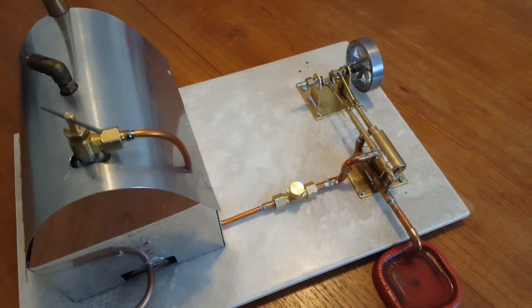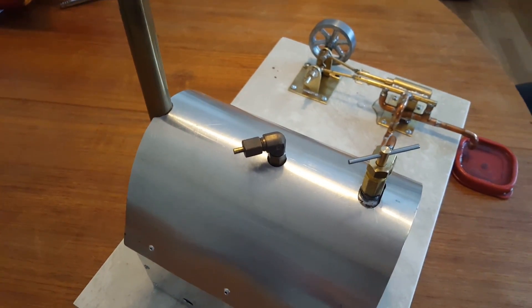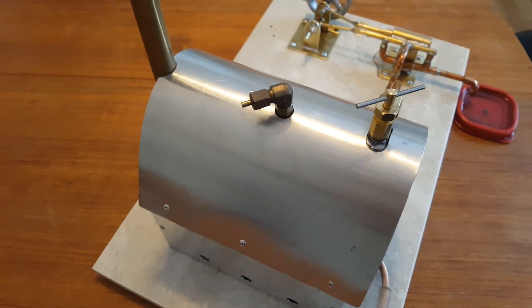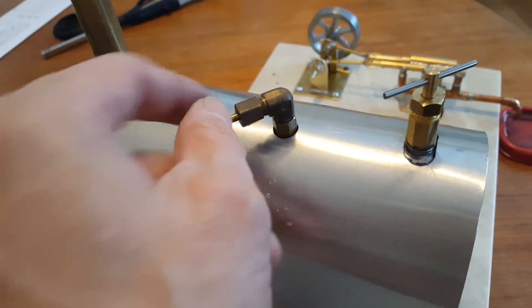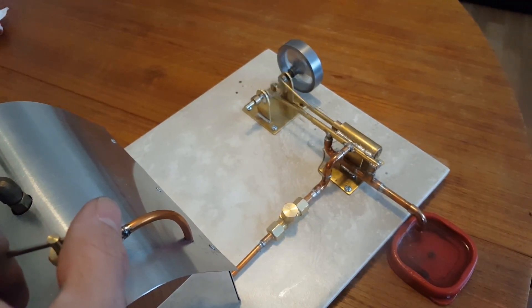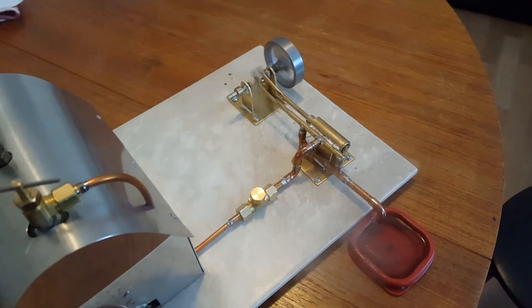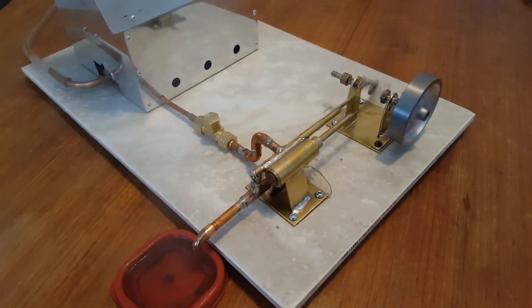Here I'm letting the pressure build up and I want to test the pressure relief valve that I made for it. It's made out of a brass fitting into which I machined a needle valve with a little seat on it for the spring. It's working really well — it pops at 10 psi and it's adjustable. The range is pretty much 6 to 10 psi.